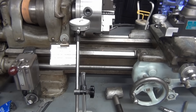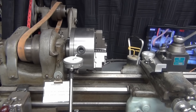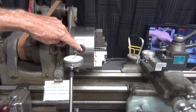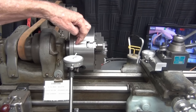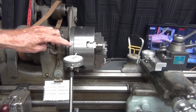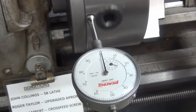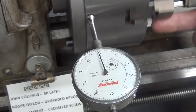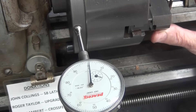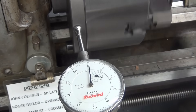I've got the magnetic base down on the table itself and I'm going to check two things. First, the runout of the chuck body — I had to position the tip of the indicator off to the side of the square hole and away from the chuck jaws. I'm checking the runout on the body of the chuck right now and there's not much — probably about two thousandths runout on the body. That's quite good. And now I'm checking the runout on the backing plate only, not the chuck. That's very good — only about a thousandth runout. That's better than the chuck.